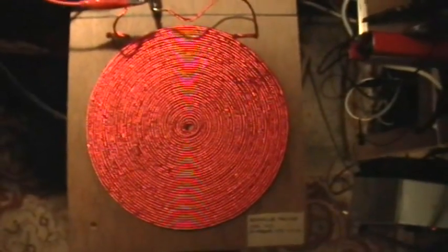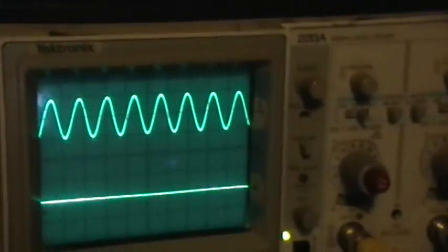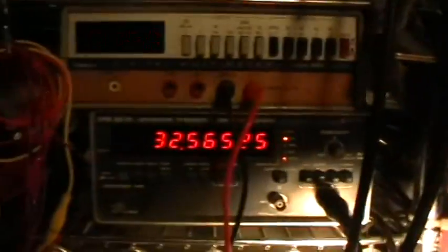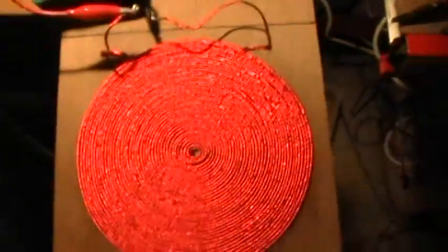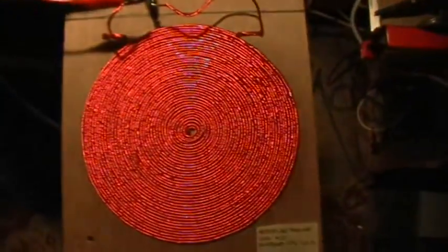Now I'm going to pause for a moment and set up to make the resonant frequency determination by soldering together these components. This is a 62K ohm resistor that I'll use to attenuate the input from the function generator. We'll be using the Interstate F43 function generator, the Tektronix 2213A oscilloscope, and the Philips PM 6676 frequency counter to do this determination. Stand by while I set up.